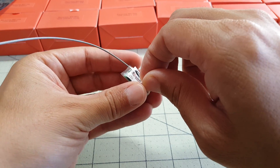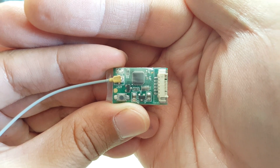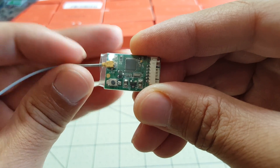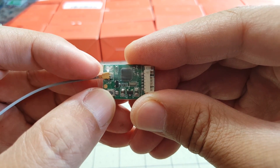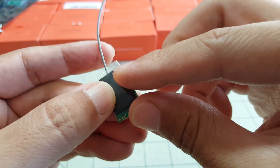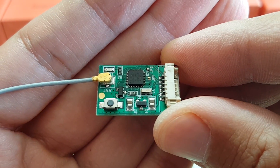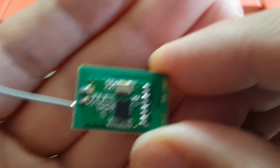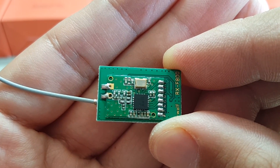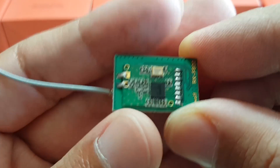Okay, let's peel this sticker off and take a closer look at this. So you've got your antenna here with a micro UFL connector, and you've got your bind button. Here's the back — it's got some foam or something underneath this heat shrink. Here's a closer look at it with the heat shrink off — here's the front and here's the back with that black foam removed. This looks vaguely familiar like a lot of the DIY FrSky receivers, but it looks like they've miniaturized it somewhat to get it in a smaller form factor.